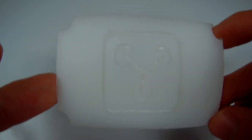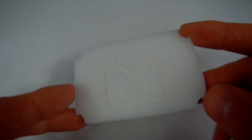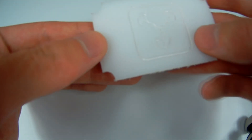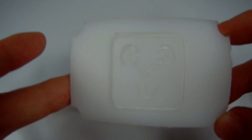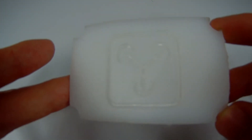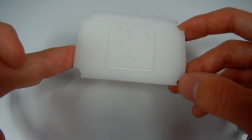So this was a bit of a complicated design and the tip is not great for cutting this stuff. This is HDPE — it's a plastic used a lot in cutting boards and it's the material I really want to use because it makes great combat robots. But it is a very hard material to cut. If you go too fast it tends to melt rather than cut, which is where a lot of this messy stuff in the middle has come from — it's melted and then re-fused into the gap. That particular knife blade that came with the machine probably wasn't great. I need to find a little end mill, which apparently are quite cheap on eBay.